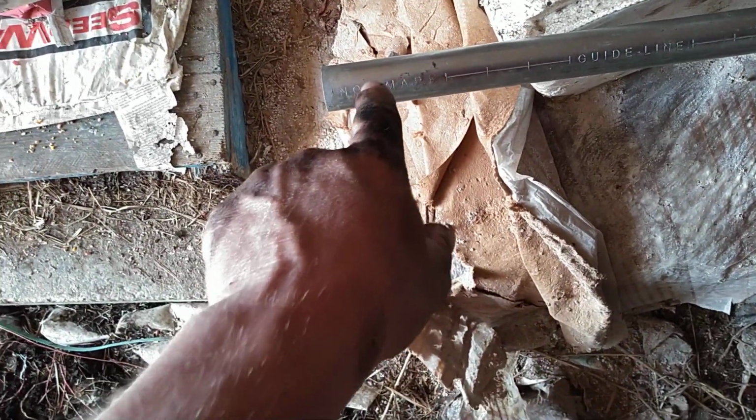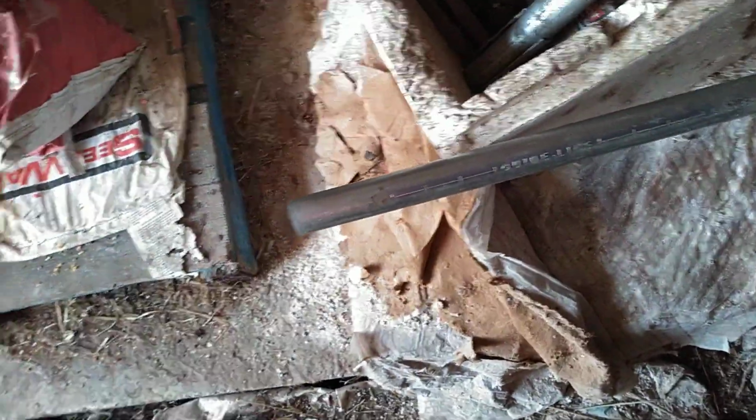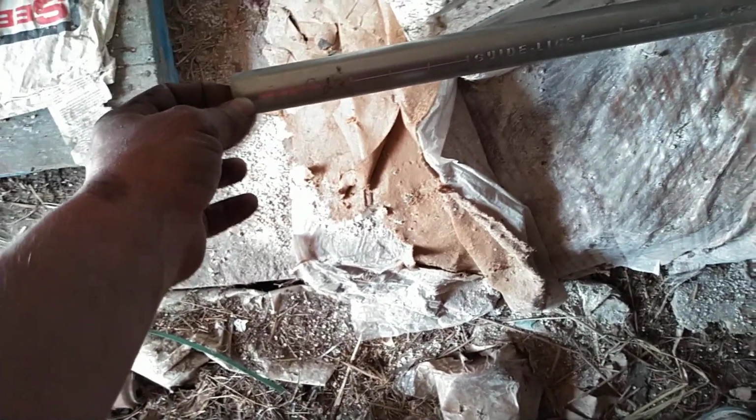It'd be the standard connectors that you connect these tubing together with. They'll just slip over. The problem that I had with them is they've got screws threaded in them and they'll just butt up against this, which I don't want, because for wire you don't want the screws all the way through. You just need to hold the connection together. So what I was going to do was take the screws out and use self-tapping screws to drill through so it goes into this pipe. The other thing was that those screws would stick out further, where this will put them down more flush, and then tape over them.